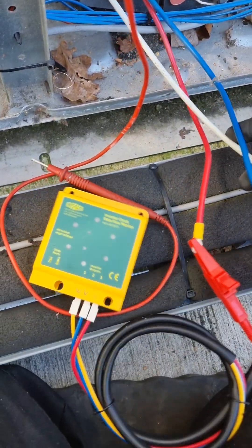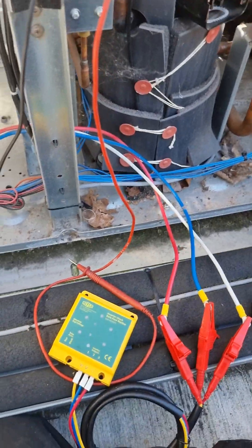With this particular model you've got to flick JSW10 number four because it's MHI's KR6 — it's not just a current sensor. It uses simulated DC voltage for the compressor but does it in a way that follows an AC curve. Some manufacturers like Daikin and Mitsubishi Electric use other current sensors. So we'll flick that and power it back up.